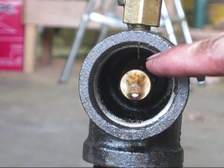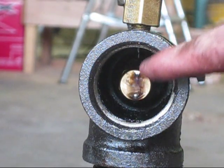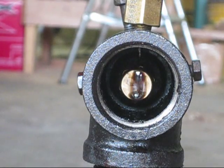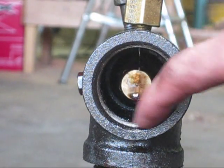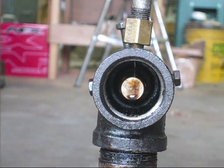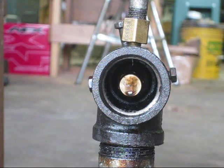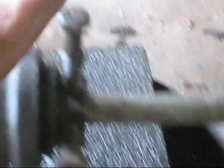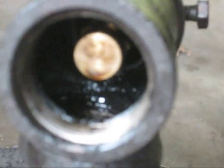Now that's what that little piece of wire is for. If you see the oil that's dripping, it's dripping directly off the wire. If you didn't have that wire in there, it would run down the sides of the tube — I had that problem a long time ago and could never figure out what was wrong. So that's what the wire is for. If your oil is not dripping directly on the head of the bushing, you'll have to adjust the bolts holding your air intake — just loosen them and pull it back and forth until you get it lined up. Once you have that, you are good to go.